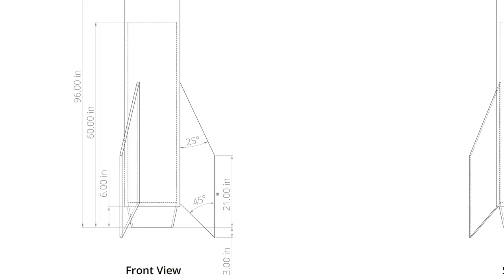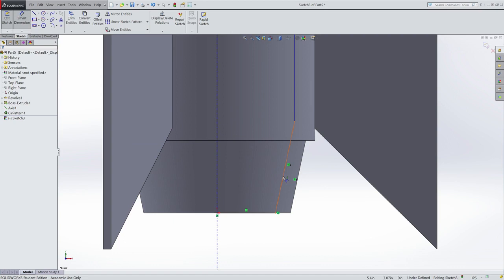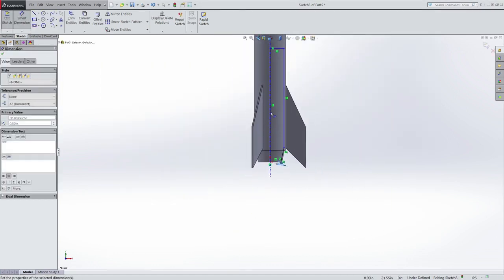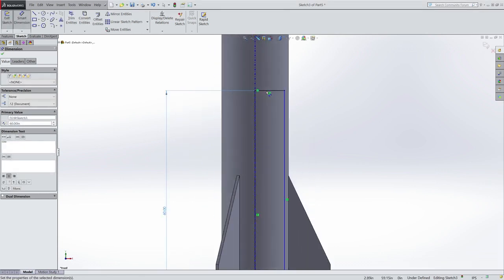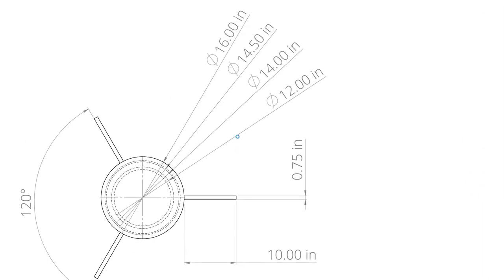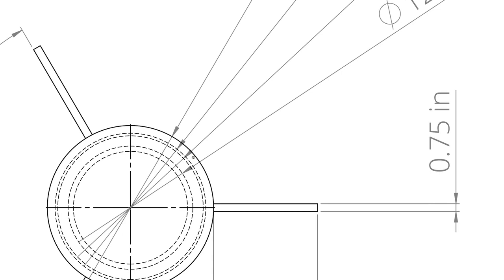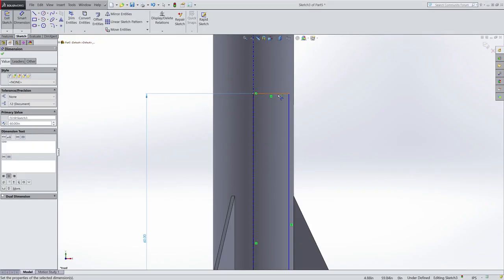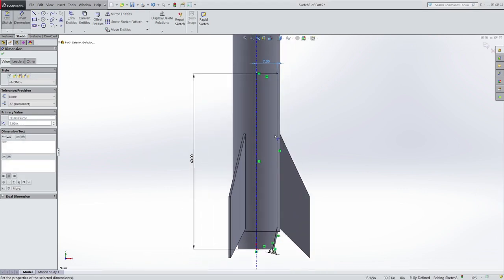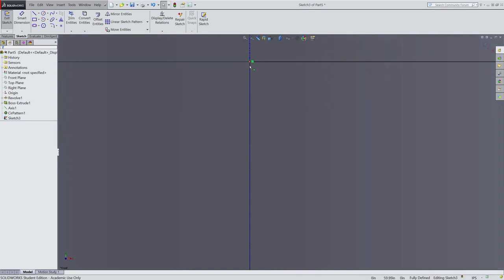Now I can start to dimension. I read that I need a half inch — the nozzle has a thickness of half an inch. So I click on this line and this line with a smart dimension and tell it to be half an inch. Next I'm going to add a height — in the front view I see that the height of that cut-out section is 60 inches, so this line needs to be 60 inches tall. Then I can add a radius distance. Looking at the top view, that is going to be the second hidden line — not the first hidden line because that's the top of the nozzle — and that has a diameter of 14 inches. So that 14 inch diameter would mean that I specify a radius here of 7 inches. Now that sketch is black — it's fully defined.